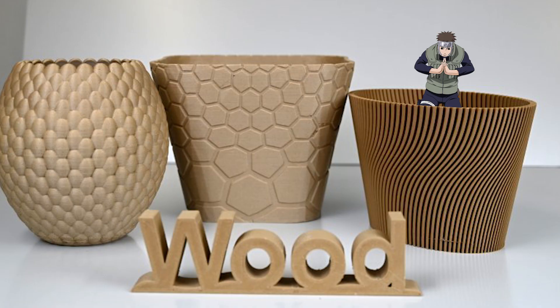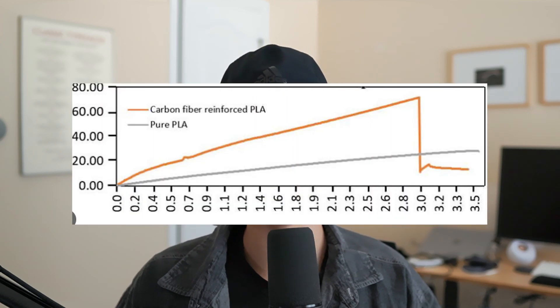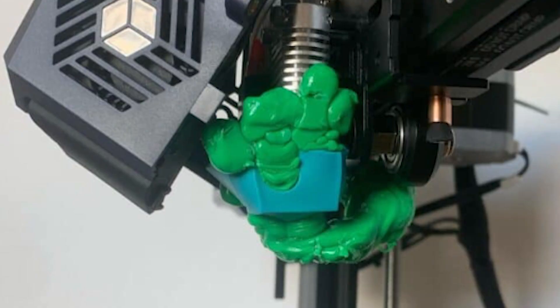A second benefit is having the ability to print more abrasive filaments, like wood filament for example, without risking frequent clogs. I usually print with PLA, but for more functional prints I think there's a lot of structural integrity to be gained by using filaments with composites in them — things like wood particle filaments and even carbon fiber filaments. I haven't been able to print with these materials in the past; the particles would clog the nozzle and I'd get a jam. I'm hoping that by having a wider opening, the jams will be less frequent.